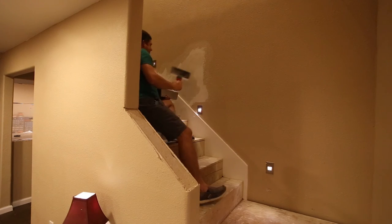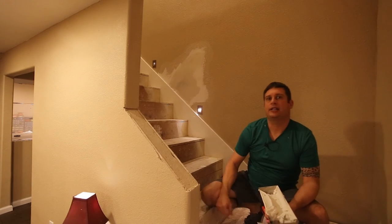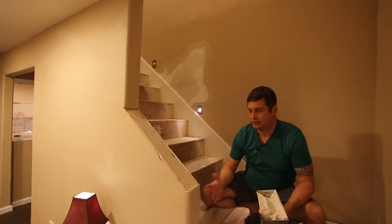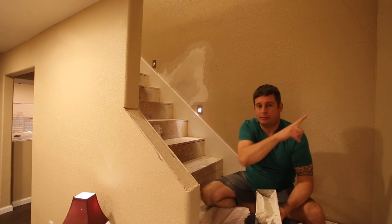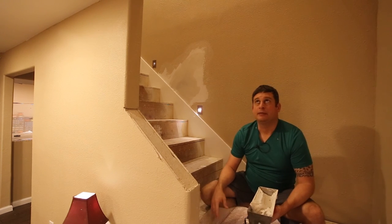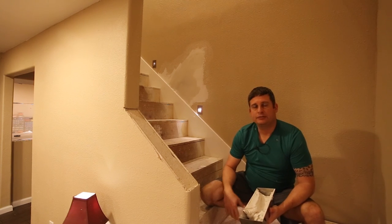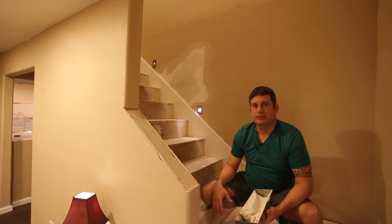All right, so that's basically done. Got a couple more spots over here. I'll let this dry overnight — it will actually cure in about 20 minutes, but I only want to do so much tonight, it's a Monday. I'm gonna put a little bit more mud on the patch that's off camera, got a couple other spots I'm touching up, then I'll wash this out and call it a night. Thanks for watching — stay tuned for part three where I touch this up, and probably a part four where I texture it, prime it, and paint it so you can see the finished result. Appreciate you watching my videos.